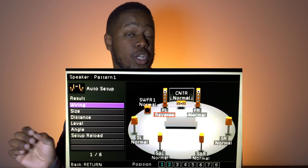This really only becomes more important when you have multiple subs. In your receiver you may see a setting that says 'normal' or 'reverse' — that is the same as zero or 180 degrees. You don't want to set your phase in two different places. If you have the option to set it in your AV receiver, pre-processor, or DSP, set it there but do not also set it on the sub, because you'll reverse what you've done and end up back at zero.